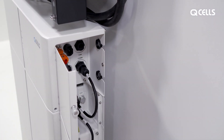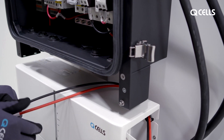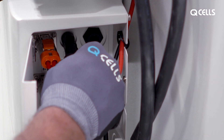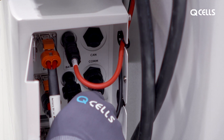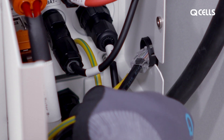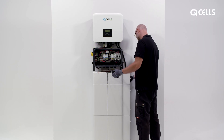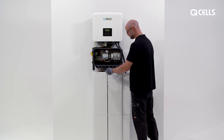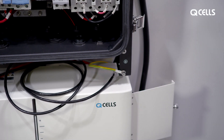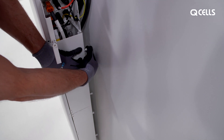The guard rings for the cable gland are placed on the recess on the BMS. The battery cables are pulled through the upper guide and left in place for now. In the BMS, the positive and negative power cables are connected to BAT positive and BAT negative. The communication and earth cables are plugged into the provided connectors and routed through the lower recess to the MateBox. The communication cable is also left in place for now. Screw the earth cable to the MateBox. You can now close all the flaps.